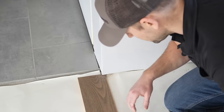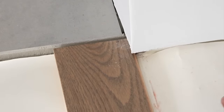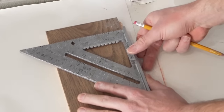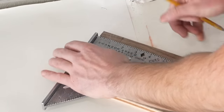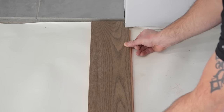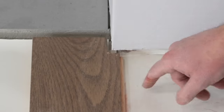We know we need three-quarter inch from the plate in the back of the wall, so I come out about a quarter inch away from the drywall. I slide the board over to the tile, leaving a three-quarter inch gap there as well. I use a speed square to mark where the notch needs to be cut to get around the wall, then take the jigsaw and cut that notch out. Placing it into position, we've got the three-quarter inch gap back by the tile, just about a quarter inch gap off the drywall — three-quarters total accounting for the plate behind the drywall.